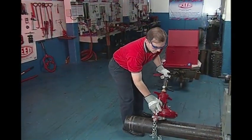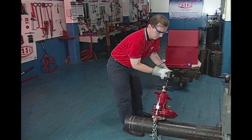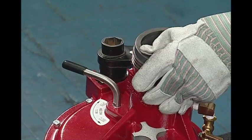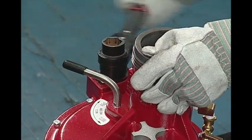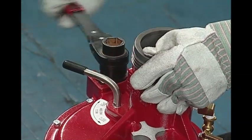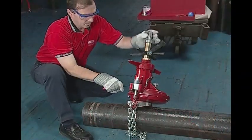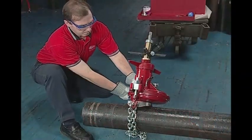The next step will position the chamber at a desired angle. Tighten down the chain nuts evenly using an adjustable wrench or a 1¼-inch socket wrench. Ensure the gaskets make good contact and verify that the chain holds the machinery securely onto the pipe and saddle.